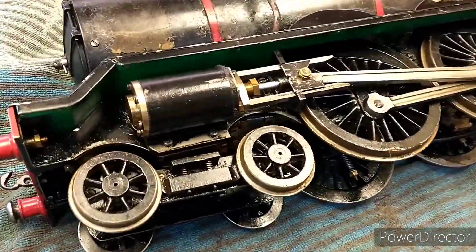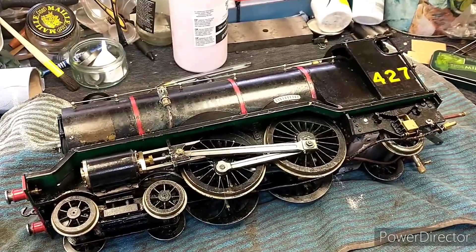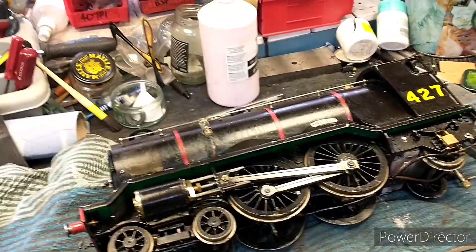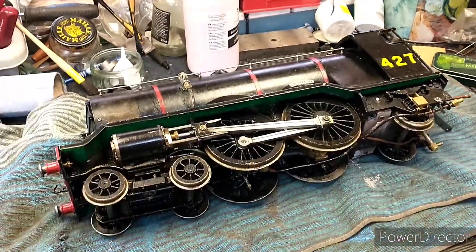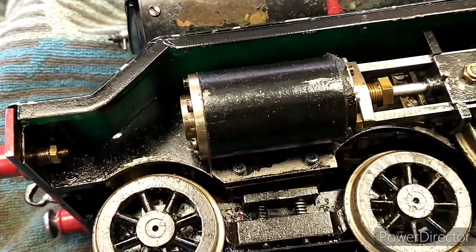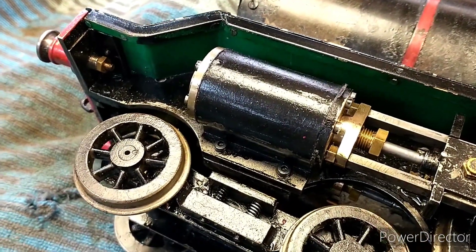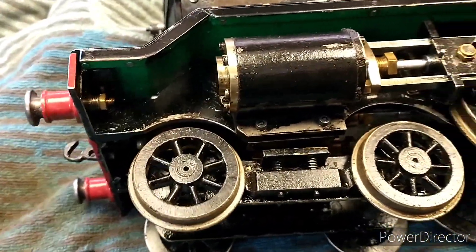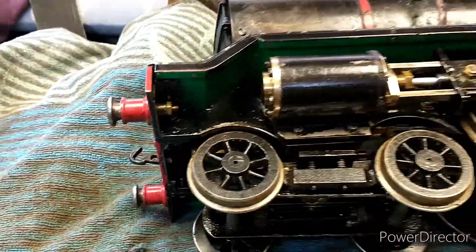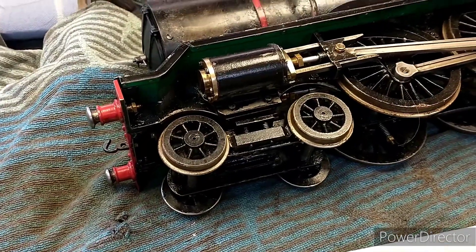Today's subject is Aisha. Although she was running okay at higher speeds, last time I ran at low speeds on slightly higher gradient parts of the track it was struggling a little bit. When I took the cylinders off last time I noticed that the piston rings were very loose in the bores, which suggests the piston rings have worn. The piston rings are cast iron, as are the cylinders, but I've decided to try making PTFE piston rings.